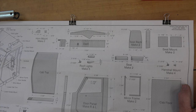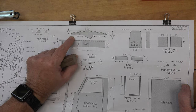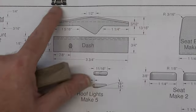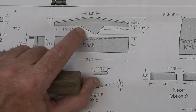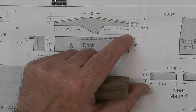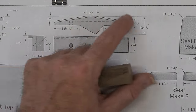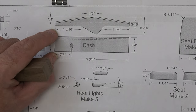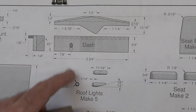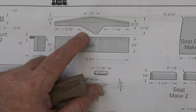There are a couple of ways you can go about this — the easy way or the hard way. The easiest way is to glue this onto a piece of quarter-inch thick MDF or hardboard and make a template. There are a lot of measurements missing off of this top profile, so it's very difficult to duplicate by hand — things like angles, radii, and center dimensions. Using the original print, photocopying it, and making a marking template is the way to go here.